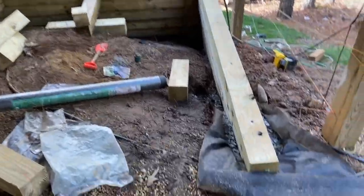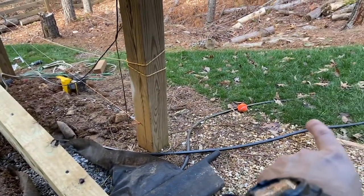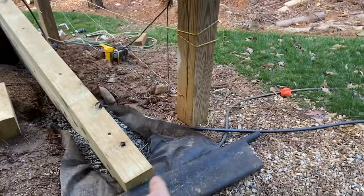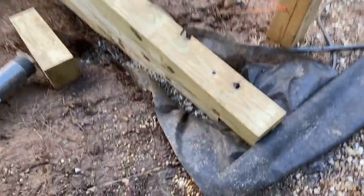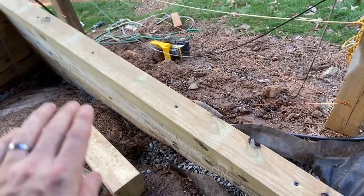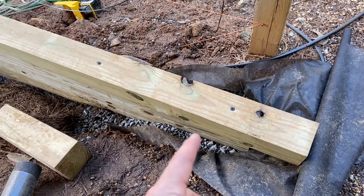The big part of the retaining wall is done. I'm going to take that piece there and add it right there to create a barrier, because my kids push the gravel down the hill. I've got landscape fabric in place. As I went up this hill I stepped it — dug out for each next board — making sure I went back at least a foot. The only time I couldn't go further back was right here where the other board ends.